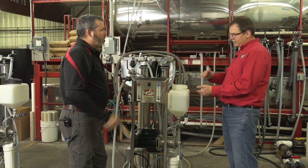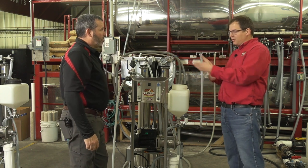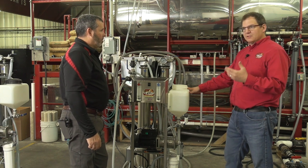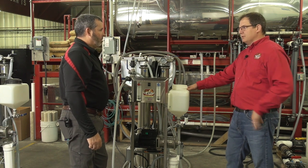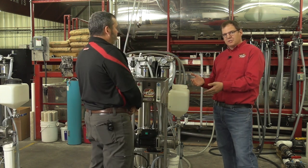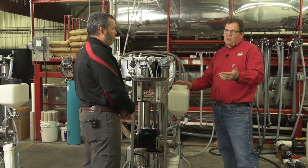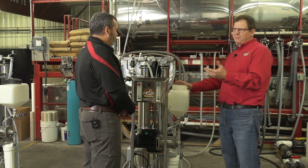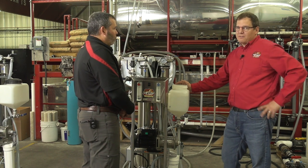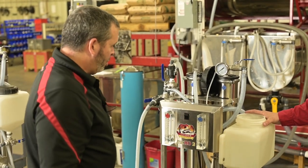That small amount of liquid with this machine turns it into a closed loop — the machine just circulates and heats up. To start, you disengage your pressure switch, then turn on M1, then M2, and engage the pressure differential switch. Now the machine is in wash mode. If we're starting cold, it may take 10 to 15 minutes to warm up, and we want to add soap right around 70 degrees Fahrenheit.